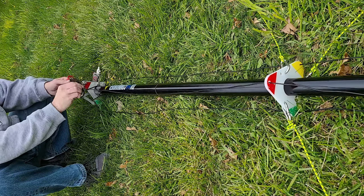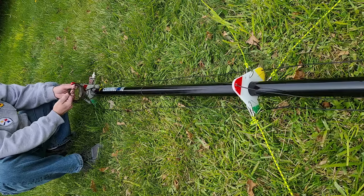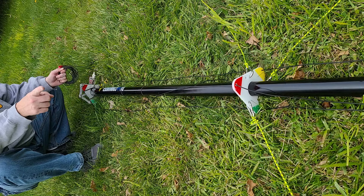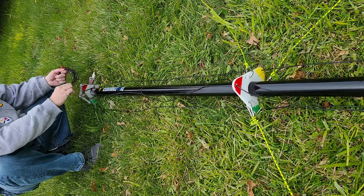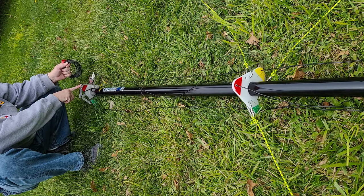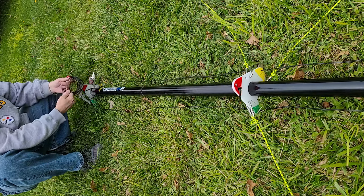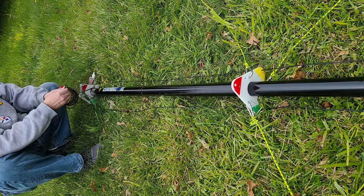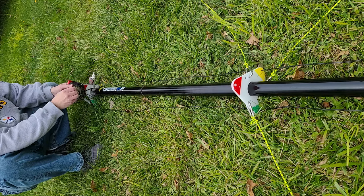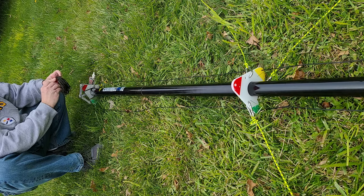Even though I'm not going to throw them out, I still don't want them getting tangled. It doesn't really matter which spot on the DX Commander you put which element, but you don't really want to get them crisscrossed. If you start on this point for the 20 meter element, you want to stay on that point going up the pole. Having everything color-coded means you don't have to think when you get to the next junction. And every time I have to think is usually when I make a mistake.